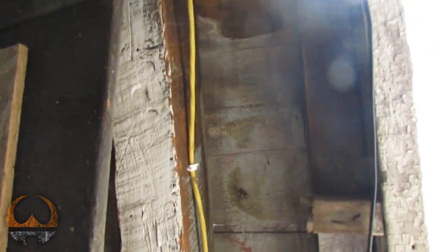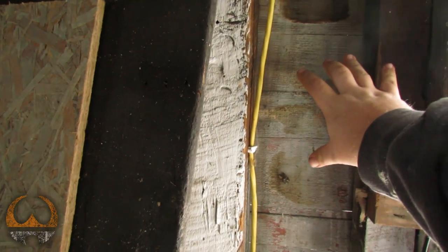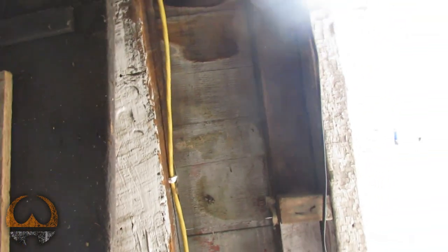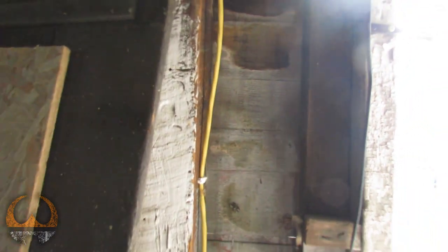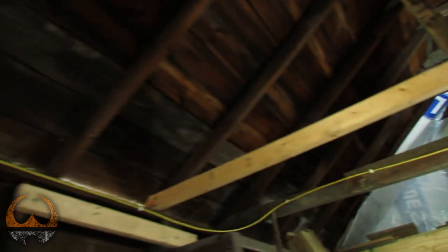It runs down into this switch, and then the switch runs into the breaker in the house. That's all going to be changed for all of the electricity to the shop, because there will be a box here that will have all the breakers in it, and everything will be run out of that and distributed how it should be. Since this wire is already run, and it'll be a good way I can test out the lights, I'm going to go ahead and start running the wire